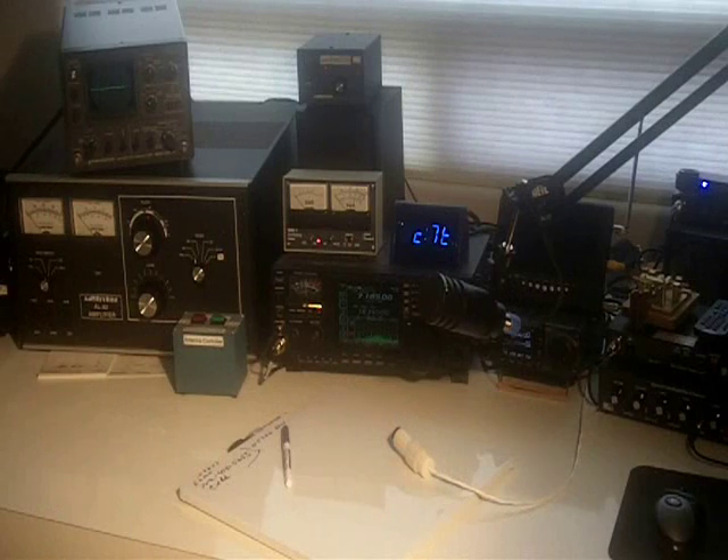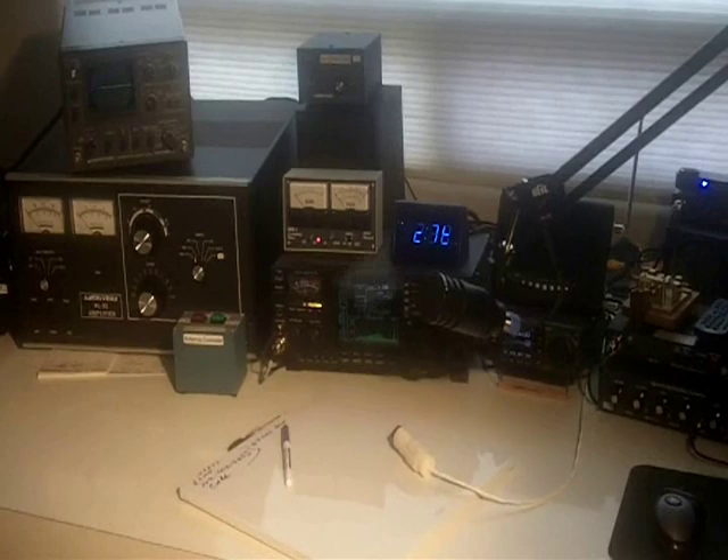The following demonstration relates to the 80 through 30 meter version out in the yard in the antenna farm. I'm going to attempt to make a contact on the 40 meter band. Just to give you a demonstration of switching antennas, I'm going to use a 390 foot off-center fed doublet antenna, which is 2.8 full wavelengths long and has considerable gain in certain directions on 40 meters. It'll give you an idea of just how good this six-foot diameter helically loaded magnetic loop works.